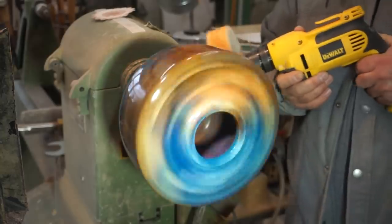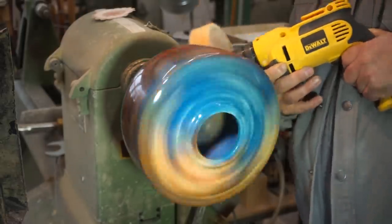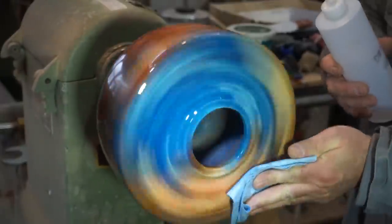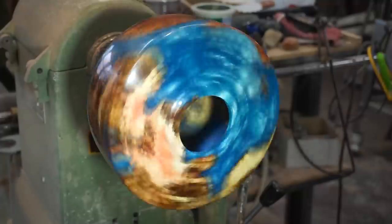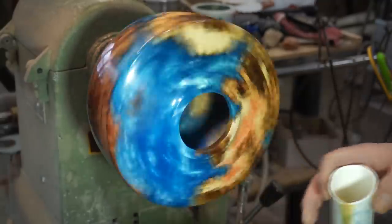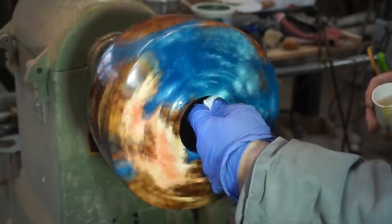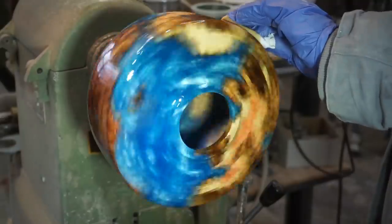It's the next day and just like I always do, I'm using the brown Triple E between coats, then the denatured alcohol to clean off any of the buffing compound. As you can see, the urn is not perfectly on center but that's not a big deal - it's just there for finishing purposes and not turning purposes. This is technically the third coat. What I did last night was I came out late in the evening and put the Water Lox on the wooden pieces - I didn't put any on the resin part. The resin really only needs one coat of finish where the wood needs multiple coats, because wood absorbs the finish and resin does not.